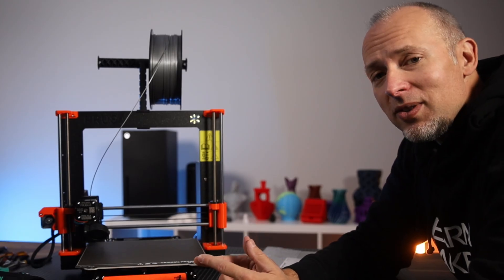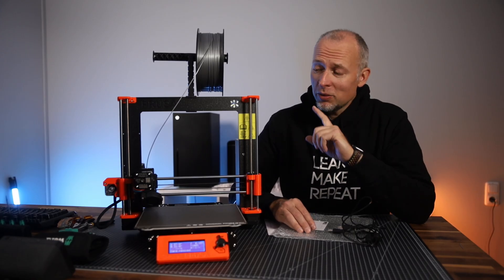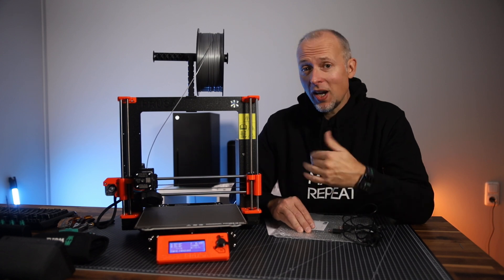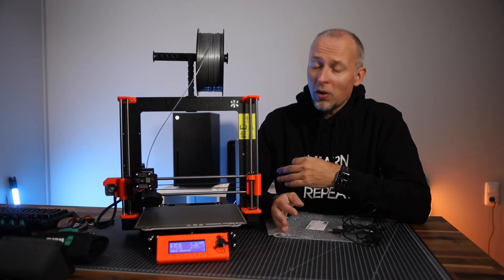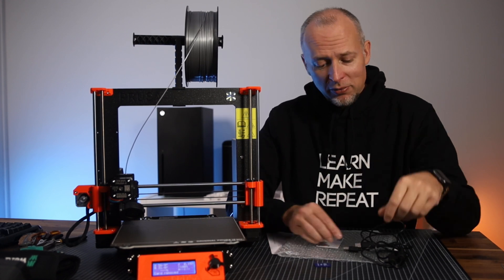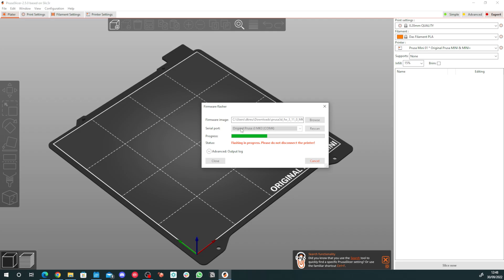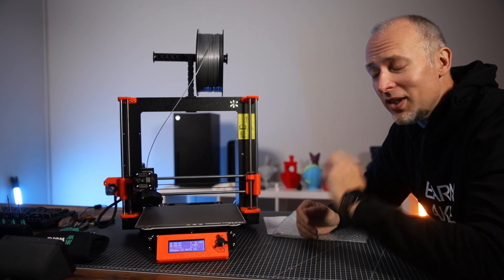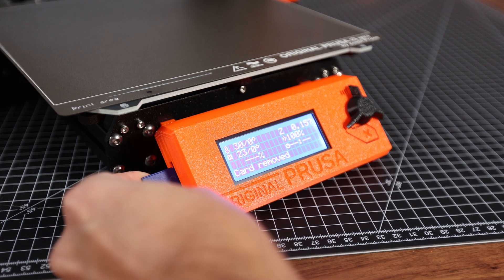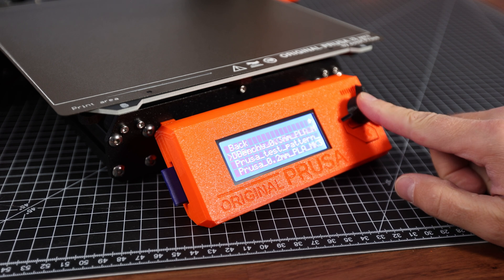What I would do now is flash the latest firmware to this printer and then we're gonna do a Benchy print. Flashing the firmware to this printer isn't as easy as with other printers nowadays. Normally you'd expect to just put the firmware file on the SD card, like it works with the Prusa Mini which has a more up-to-date mainboard, but with this mainboard you still have to use a USB cable, connect it to your computer, and use PrusaSlicer to update the firmware. Flashing succeeded! Disconnect the cable. We're ready to do the first test print. We'll insert the SD card that comes with the printer — there's a bunch of example files — let's pick the 3D Benchy. Let's kick it off!